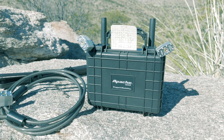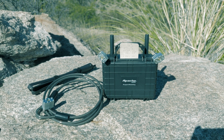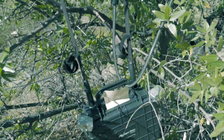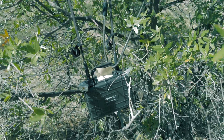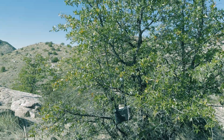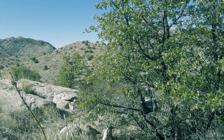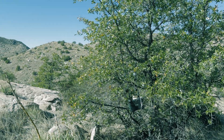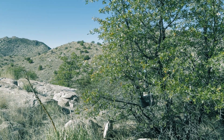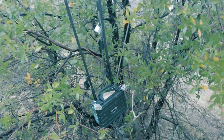So yeah, that is the under-$100 UV5R lunchbox repeater. I'm about to go get it set up — I intended to mount it in pine trees but there are no pine trees in this area, so the antennas are a little mangled going through the branches. At this elevation it should still work fine. I also have someone down in town about 10 to 12 miles away, and I'll see if he can key it up and reach it.